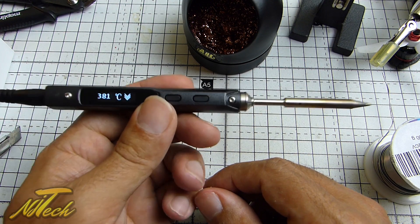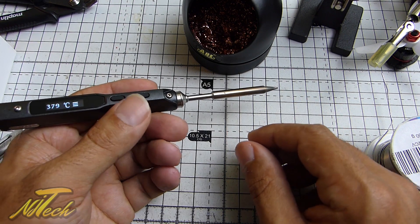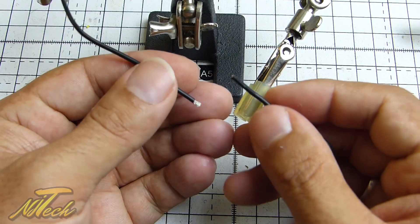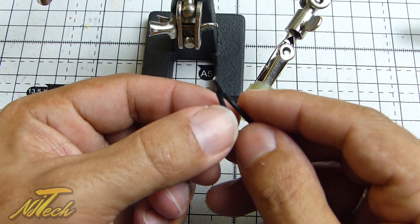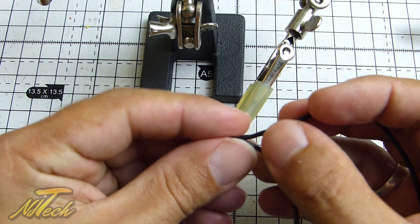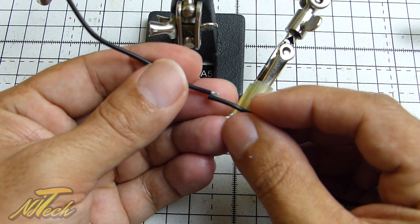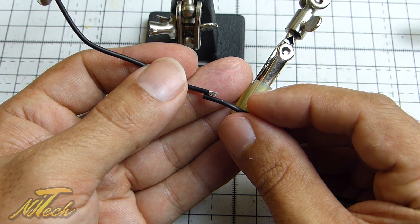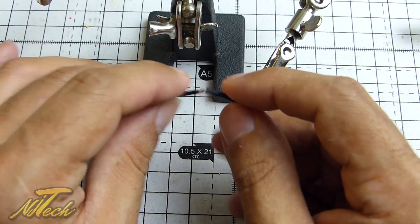I'll put links in the description — go and get one. While we're here, let me show you a quick soldering tip. I've got a series of these I'd like to go through over the coming months — small things that can help reduce the headaches while soldering. Let's look at wire-to-wire soldering. There are various ways to join two wires together. One way I see people do it is to twist them together and put solder on it with heat shrink over it — which looks absolutely terrible. Another way is to use helping hands and lay one on top of the other — but you're relying on the solder and it can be brittle and pull apart.